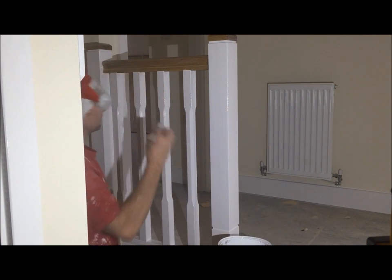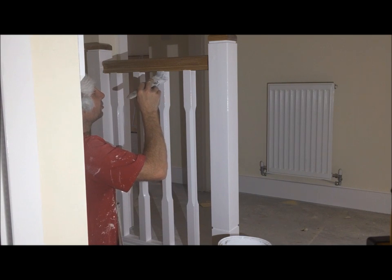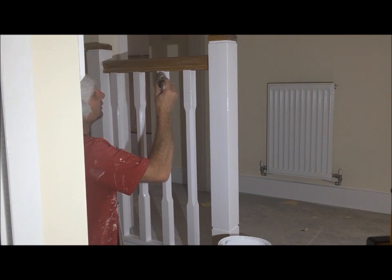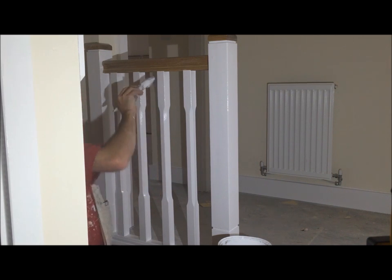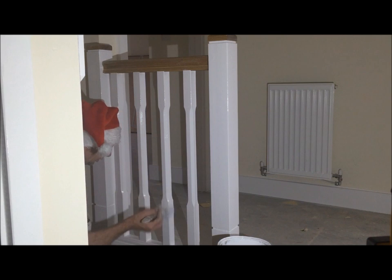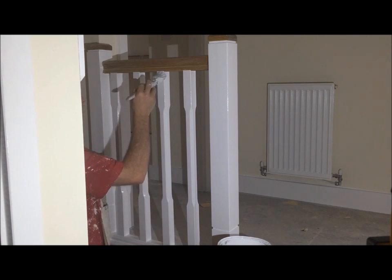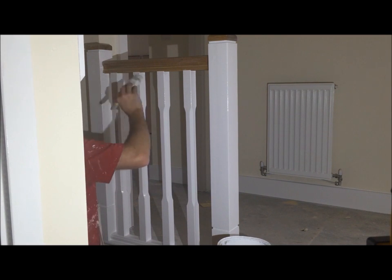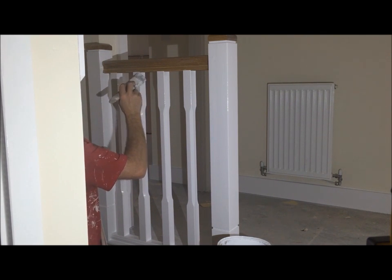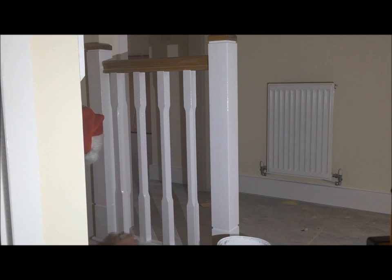Okay, start to work the brushing and just literally just push it up dead gently like that, or just run a line across there. But I must stress, you will need the right type of brush for it, okay? You're not going to do it if you're trying to use a brand new brush or a brush that's not been trimmed down. You're going to struggle to get that cut in there without touching the varnish work. And just bear in mind, it takes you longer to do it. It's not like you can hit all the underneath with a gloss, so it will take you that little bit longer.